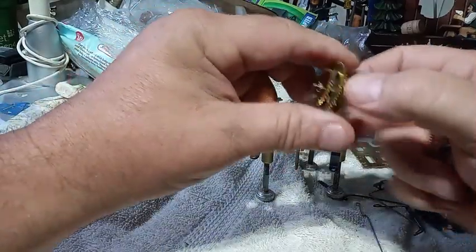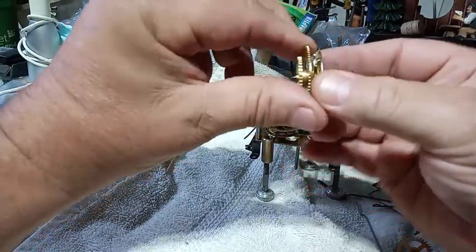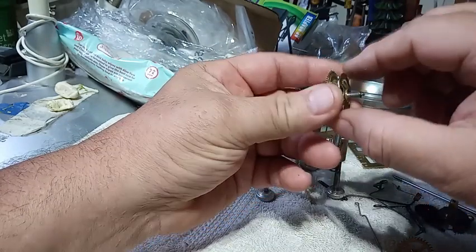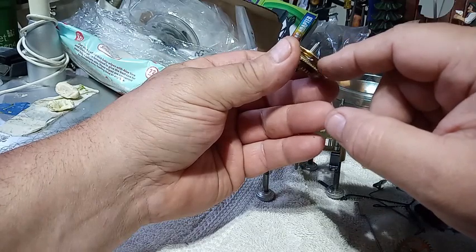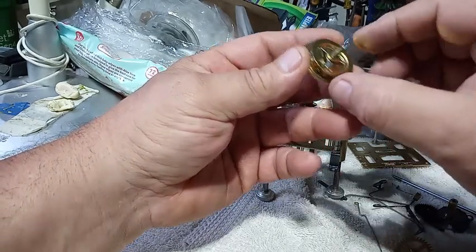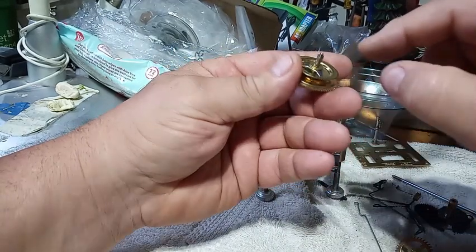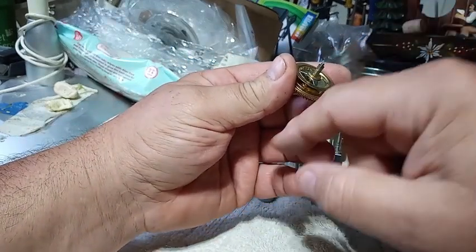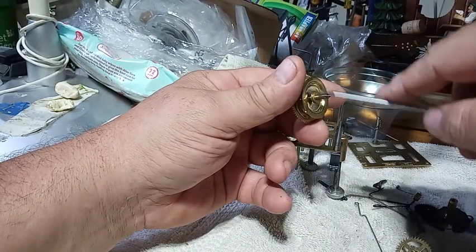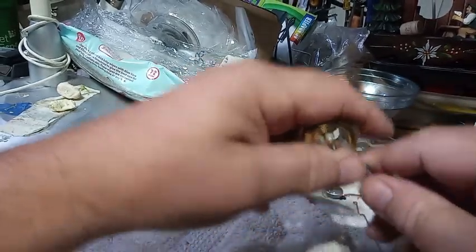I want to check the ratchet wheel to make sure it's working properly. This bushing right here is what holds the ratchet section, or the part that the chain goes around, up against this wheel here. If you had too much play in it, or if the ratchet wasn't working properly, it's because this bushing is too far down on these fingers on this piece here. In this case, it's too loose. I'm gonna tighten it up. I shouldn't be able to spin it around like that.